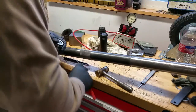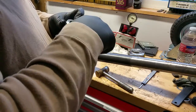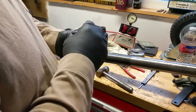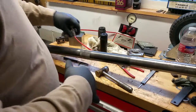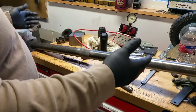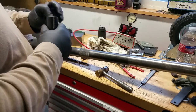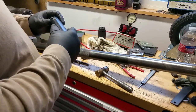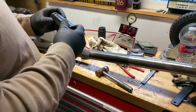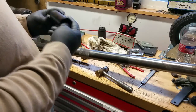Really, this bar feed is three pieces. It's just a DOM tube with a sandpaper-polished ID. It's a pusher made out of Delrin — I used Delrin because it was easy to machine, it's kind of self-lubricating, and it's just easy to work with. Putting the cone there means it's not harder than any of the metal that's going to go in this. And then there's the rotary union end cap. Let me show you the whole magic of how this thing works, goes together, and why it's so simple.